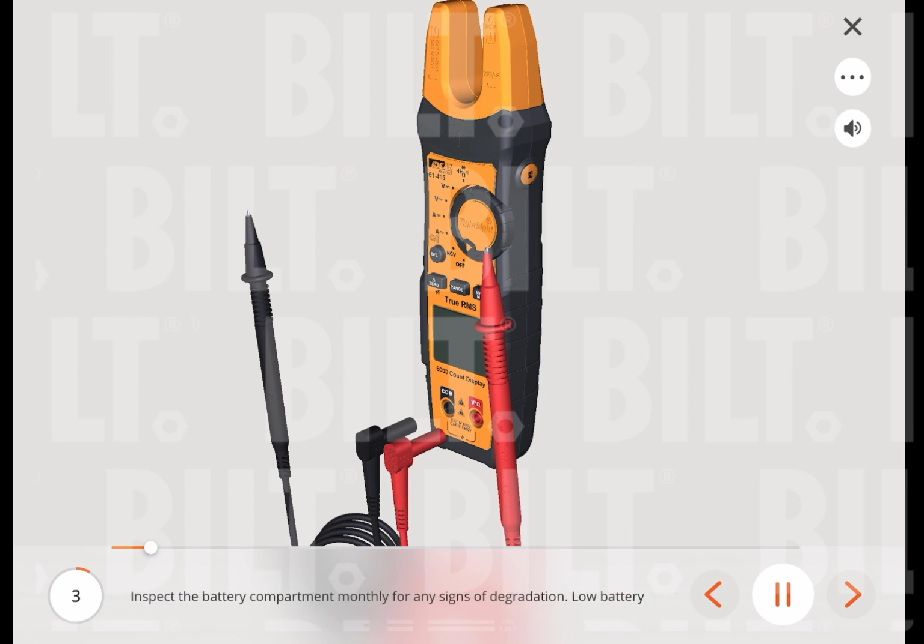Inspect the battery compartment monthly for any signs of degradation. Low battery voltages will cause inaccuracies in readings. Remove the batteries for storage or if the meter will not be used for longer than 1 month. Battery leakage will compromise the safety of the meter and cause irreparable damage to internal components.